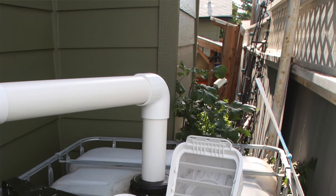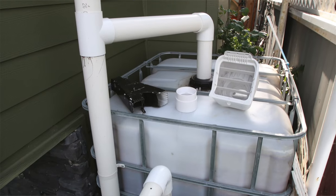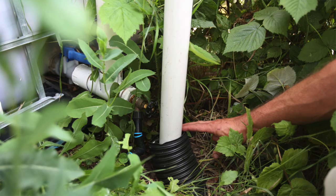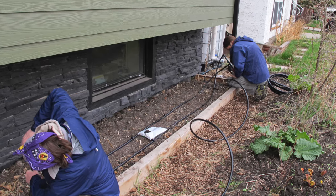That first flush of water is going to be the dirtiest water and you don't really want it going into your rain tank. Once the first flush diverter is full, all subsequent water goes into the rain tank, which is then stored for later use. The rain tank itself also has to have an overflow, which flows into those swales when the tank is full. When you set up a rain tank with a first flush diverter and a rain head and make sure your gutters are clean, most people don't know this, but you can actually harvest water off asphalt roofs and have it clean enough to drink.